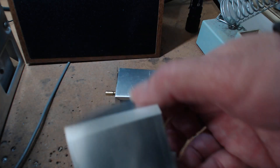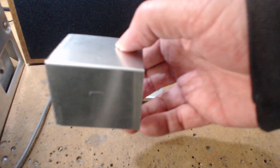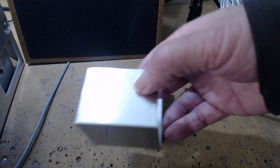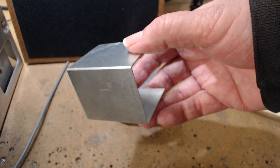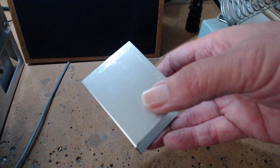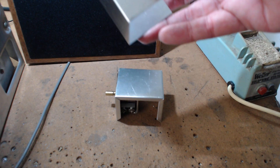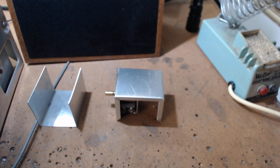This part here was a nightmare. It had to be smaller — or crossed — probably twice the thickness of this metal, approximately. With the length, you have to subtract two thicknesses. When you roll metal over it shrinks, and depending on the bend it can shrink in one direction and expand in another, depending on how sharp you can bend it.